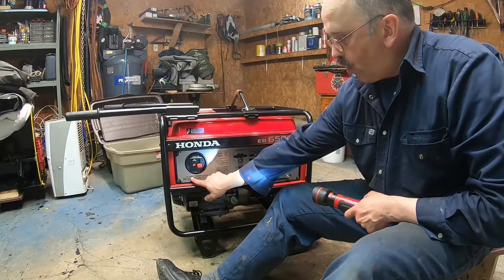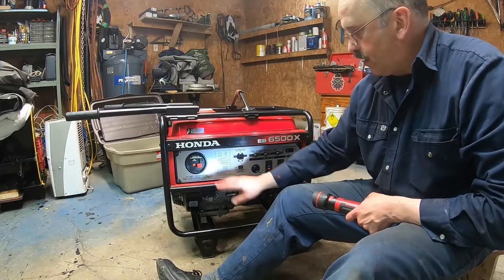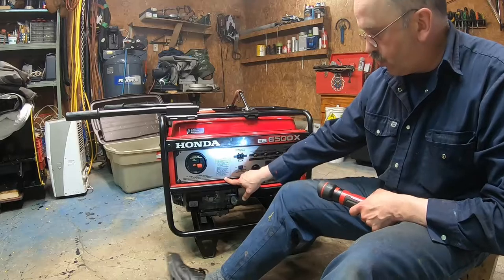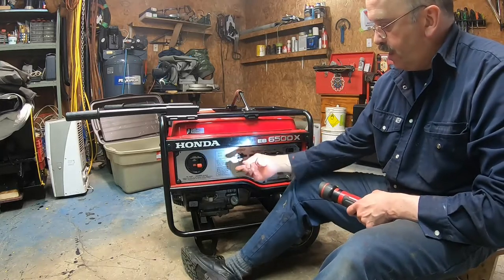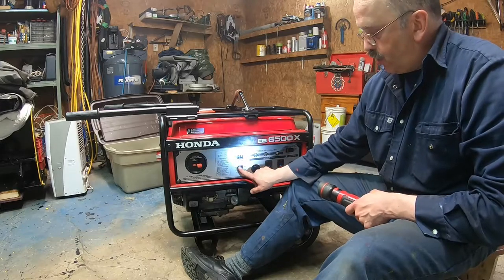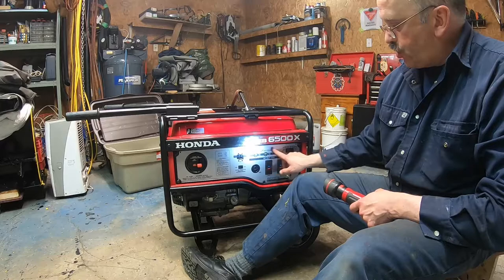It's telling you there's an oil alert. When the oil level is low, the engine will stop immediately, all right? There's how to start it also here, start the engine, all step by step. This is the AC protector disjunction. So before you start the engine, make sure it's at off. There's the auto throttle, make sure it's at off, all right? This is the circuit breaker.